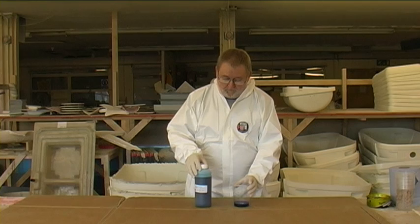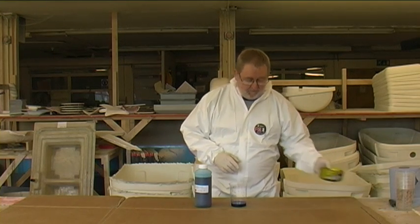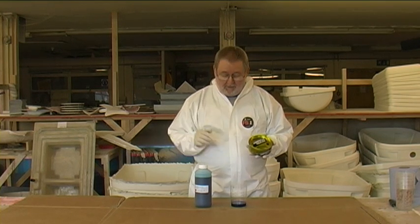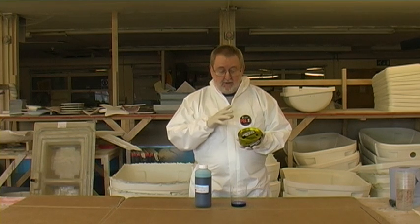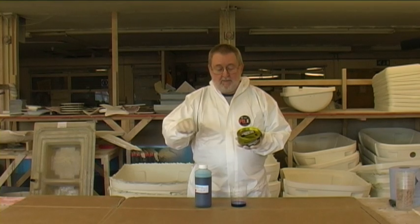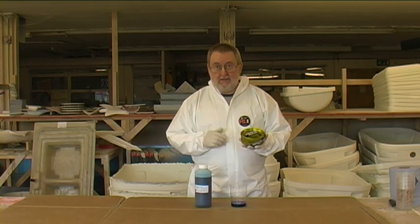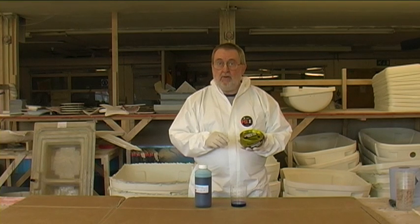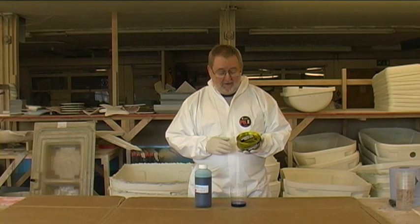You can in fact use both: put the wax on first and then put the PVA over the top. There is a tendency, though, for the PVA to run into droplets. You can avoid that if you continue to spread the PVA as it starts to set — as the alcohol evaporates and the PVA gets thicker, it will eventually form a continuous film. The problem is you will end up with brush marks or spread marks in the PVA, and they will show up in the final object.